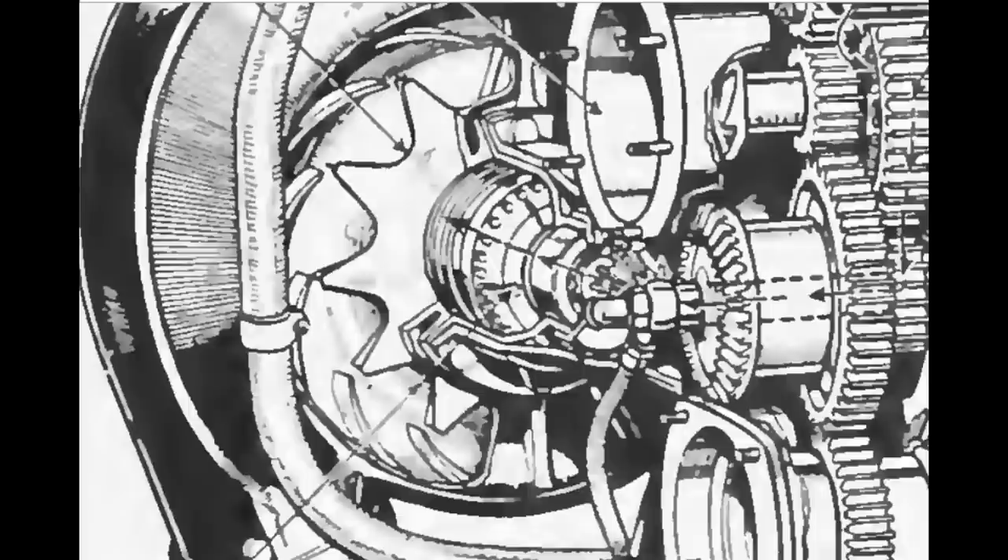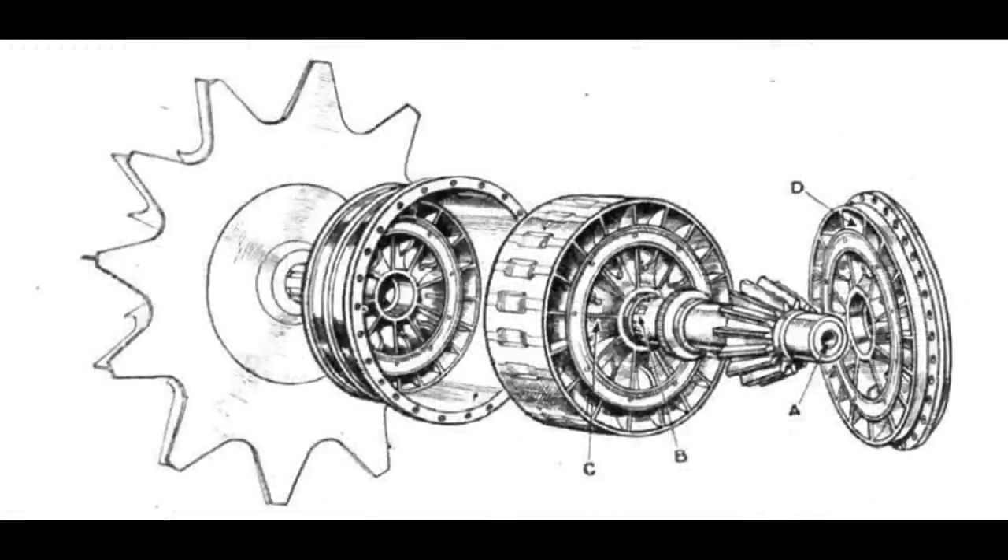At low altitudes and full throttle, the coupler will automatically adjust the impeller speed for maximum manifold pressure. As the plane climbs, the pilot doesn't need to do anything — he can just leave the throttle in place and the regulator and coupler will continue to adjust the speed so that it maintains maximum manifold pressure. This is much more effective than throttling, which means cutting off the air to the supercharger to regulate boost at low altitudes. By not having to throttle it, it allows for more performance and a wider range of operation. The Föttinger coupler in this application allows the ME-109's engine to hold maximum manifold pressure by adjusting impeller speed from sea level up to almost 20,000 feet — that's really good for a single-stage supercharger.